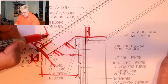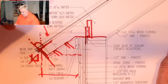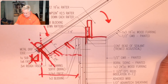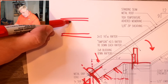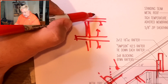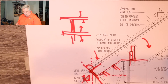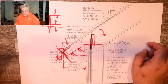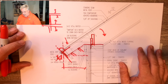On top we have our standing seam metal roof. We also have a block of wood here — because of the wind zone we're in, that block keeps the rafters from overturning. They want to turn either way with the wind loading. So we put blocks between the rafters; in plan, the rafters run out, the wall is here, and these blocks go in between to keep the rafters true and stiff. That system is tied into the wall and into the Simpson hanger — rafter, wall, hanger, block all working together. When the wind blows, it's not up to just the rafters to fight the battle; it leans on the walls, which use the roof diaphragm. That's a deeper dive than we'll go into today.